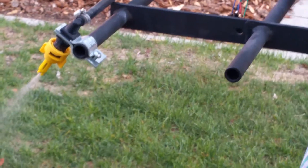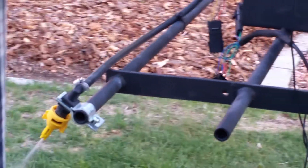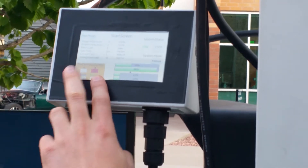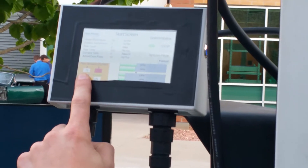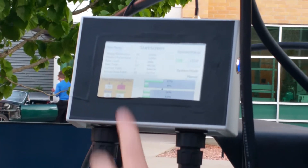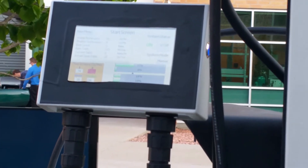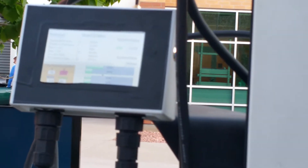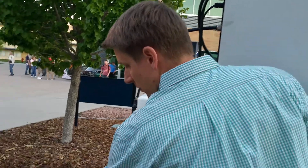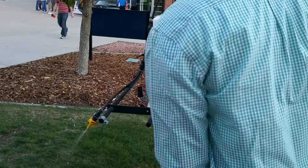There is a little bit of green in the water — the product is dyed so you can see you're getting both green product and water mixed in there. You can see the flow rate through each sensor here, and this one is displayed red. We're having a calibration issue with one sensor — one says 75 ounces a minute, this one says 33 ounces a minute. If there's too much of a differential, it turns red. It doesn't necessarily mean there's a clog, but it alerts the operator that something might be wrong — you could have product dumping through one line. It'll alert you of that as well.